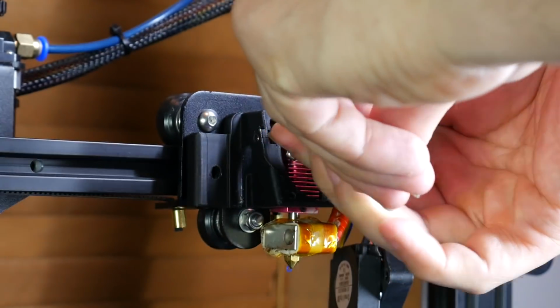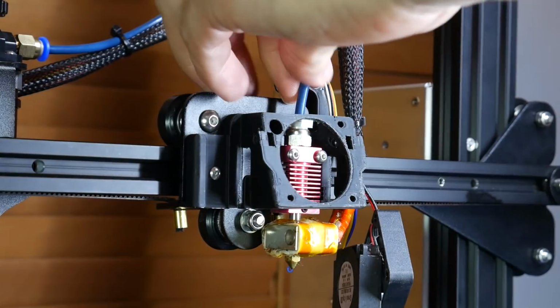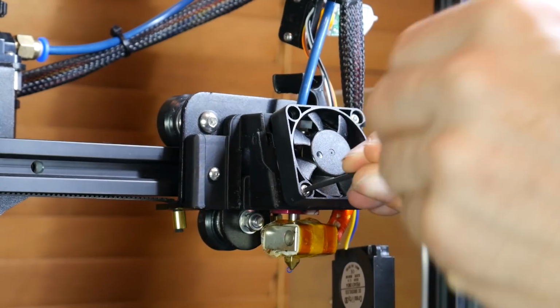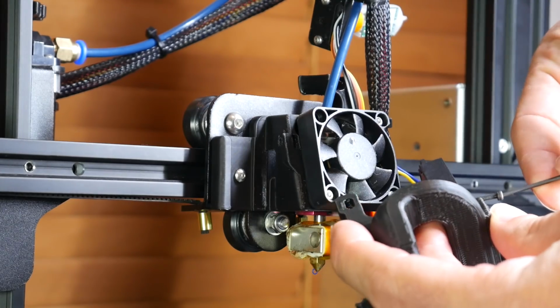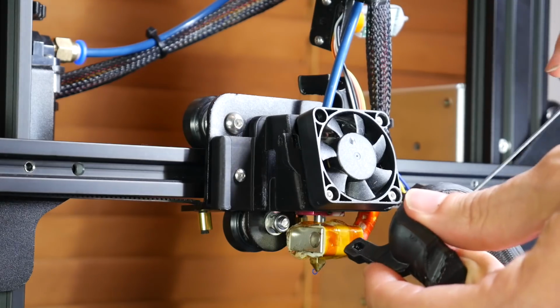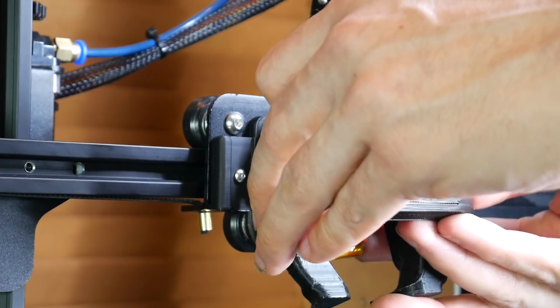The base hooks into the right hand side and then uses two bolts to hold everything in place. There is a video linked in the description from the author of the files that shows you this in an animation. The fans need to go on here. For the Tornado, I needed M3x10 screws because the ones that came with it weren't good enough. You reuse the two M2 screws from the original blower fan and you put it onto the mount. That then slides up from underneath. There's a little channel to help you keep it aligned.